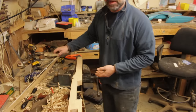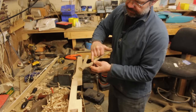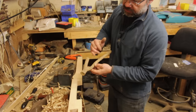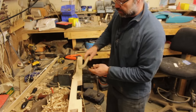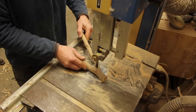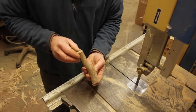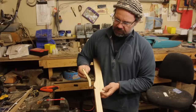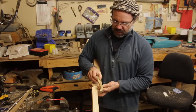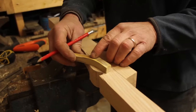The trigger is actually just like a bent piece of wood that pivots around a hole and pushes the string out of the notch. You could cut it out of any bit of straight-grained wood — ash is good, boxwood is good, they're very tough. I've actually got a bit of boxwood here with a natural bend in it, which is going to help us strength wise. I'm going to use the curve of this wood so that the grain is kept true, and cut this down to make our trigger. I've flattened it off on a sander. It's working with the grain of the wood because of that branch, so it'll be nice and tough. There's a pivot hole here and we're going to drill one into the stock, and it's going to sit there and push up.